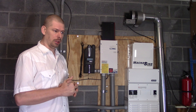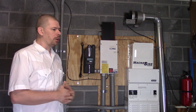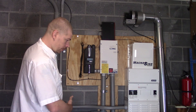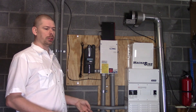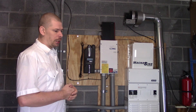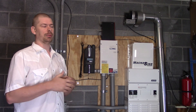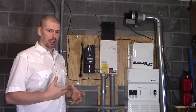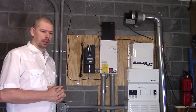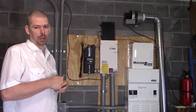The Ange Inverter drains more — it drains that just to be on. So basically I can use about 1 to 2 kilowatts a night with these batteries, using timers on refrigerators, etc. The new refrigerator we put in is about the same power consumption as the other one when it's on a timer, and on a timer it uses less energy because it runs less. I really like the off-grid system because I can turn the main panel breakers off and still have power.